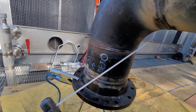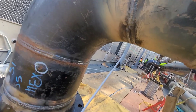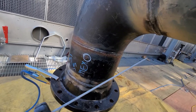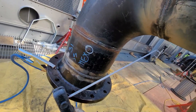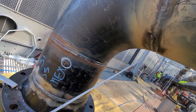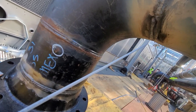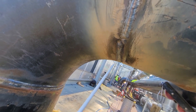I'm holding the rod this way in the stinger. I'm at this 5G position pipe. As you can see, I'm holding the rod this way. Now, when you're on the bottom, this is the way you want to hold the rod. I'm pointing this way — I'm not going like this as if I'm going up the pipe. I'm holding it this way as if I'm shooting past the pipe. But as I strike my arc, I'm gonna do an upside-down C and I'm gonna go up.